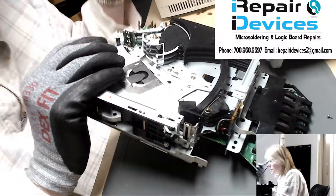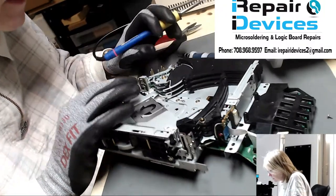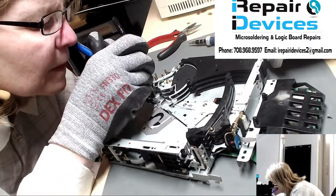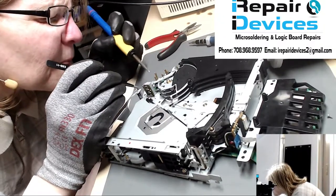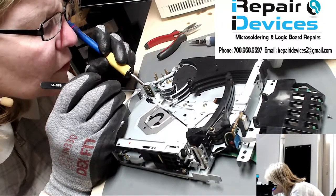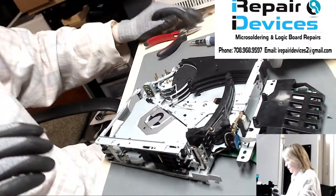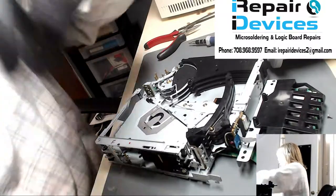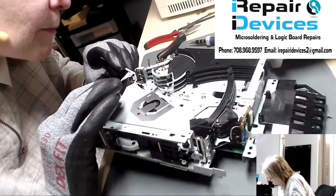I've got to squeeze back in here and get the sixth leg — it's all the way inside here. There we go, he's tapped. Center one is tapped. I'm happy with all that. So now let's get it cleaned up, and then I'm going to do a continuity check to make sure all the wires are in place before reassembling and powering everything on.